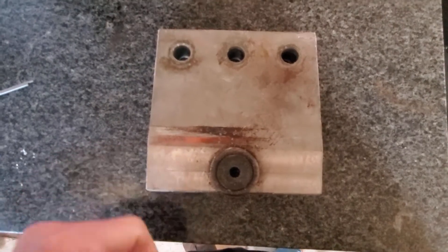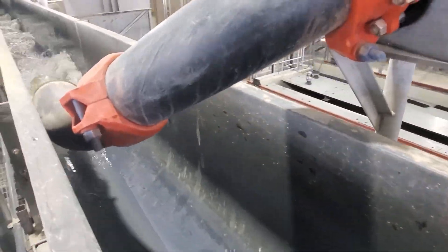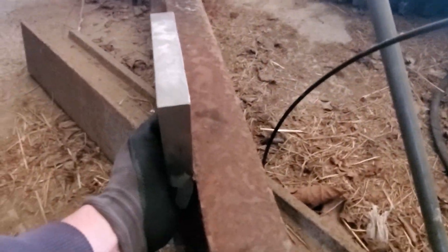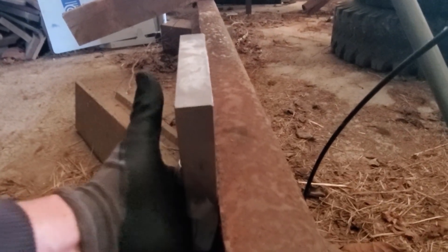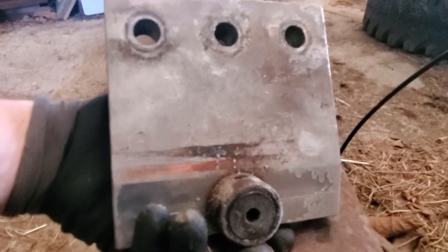Let me find a piece of rail and show you exactly what these do. Here's a rather nasty piece of ordinary car rail — I do have things like this sitting around the farm. These devices mount on a moving bridge, and they would come up and catch the underside of the railhead with that cam follower in the event that the bridge would ever try to lift. Now they mount on this surface back here, but obviously they're running a little bit too close to the sides of the railhead.